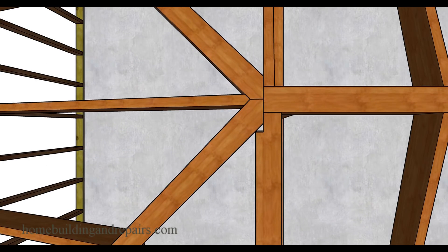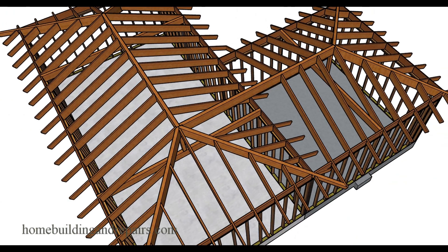The ridge beam might need to notch around the hips and the other ridge, but it all depends on which way you are going to build it. It all depends on where this beam and support is located. I have this back a little bit — I laid out the rafters and then moved the beam back. Your post might be moved over and directly underneath the ridge, but this area here could all be framed differently. One method right here.